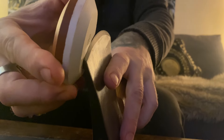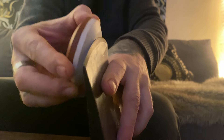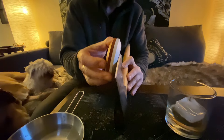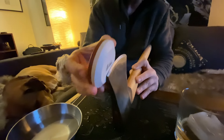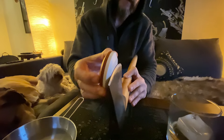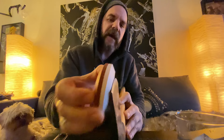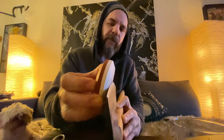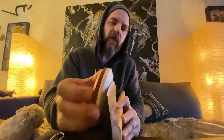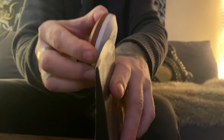The little shadow is gone. Then you want to do small little circles all the way up and down the blade, medium pressure, counting each time you go back and forth all along that angle, sharpening the one side, keeping in mind and counting each pass forward and backwards as you work your way down the blade, giving it slightly over medium pressure as you move along the edge, making your way back and forth as you go. Then you're going to repeat it on the other side of the axe.